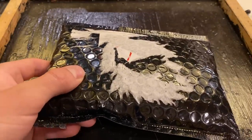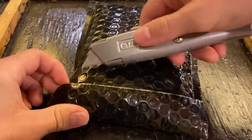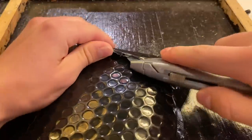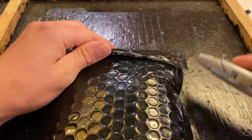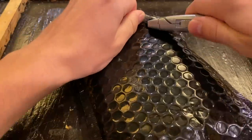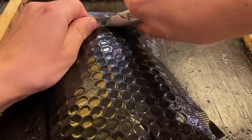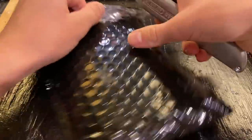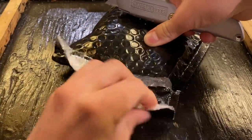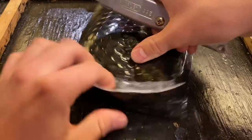I've been looking for some really cheap motors off eBay for quite a while now and I decided on these ones simply because almost all of the reviewers said they were using them for various model train projects. Some people were even mentioning putting them in Kato engines. These cost like four Canadian dollars each, so really not too much of an investment. They're skew wound five pole motors rated at about 12 volts, so pretty optimal for model trains really.